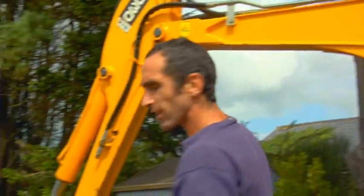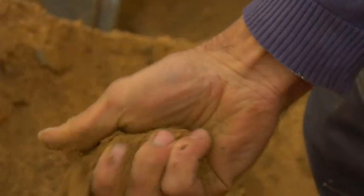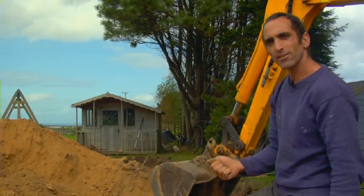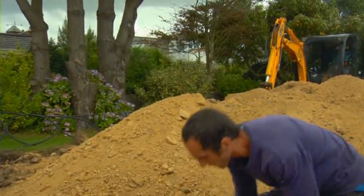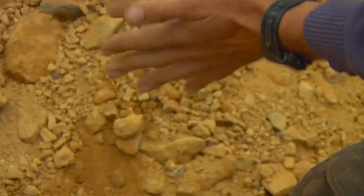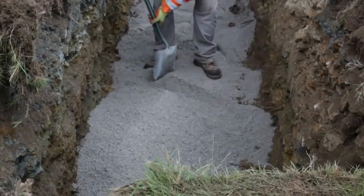One of the key things to consider is the soil you're taking out — not just where you're going to put it, but how you're going to reuse it. Some excavated material is ideal for compacting around the pipe, and it may not be necessary to buy in sand or second-grade soil. However, heavy chippings coming out of the trench are at risk of puncturing the slinky, and thermal conduction will also be poor due to air pockets. A best practice installation would feature a shallow 100 millimetre layer of fine granular material protecting the pipes from sharp edges and eliminating air pockets between the pipe and the ground.